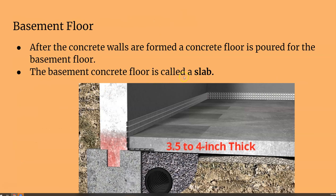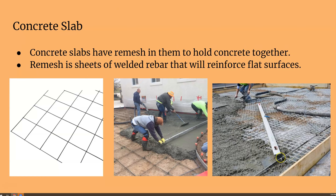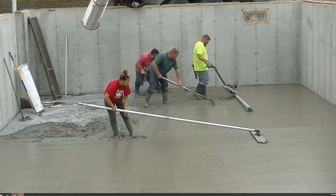After completing the foundation walls, the last step is to pour a concrete slab for the basement floor. You put down remesh — which looks like oversized chicken wire — laying flat, and then pour your concrete over it. You can see the chute pouring it on as workers float it out. That concludes the foundation wall lesson.